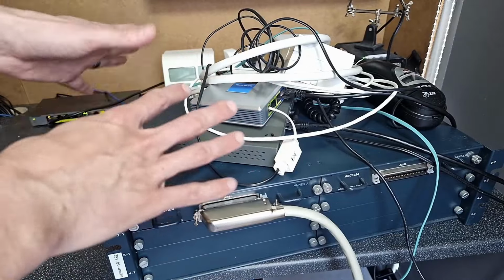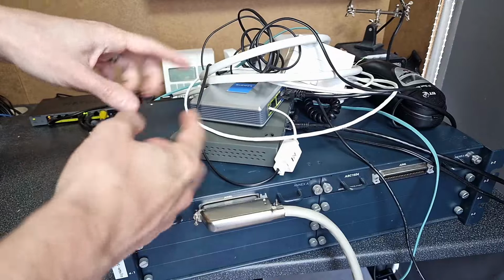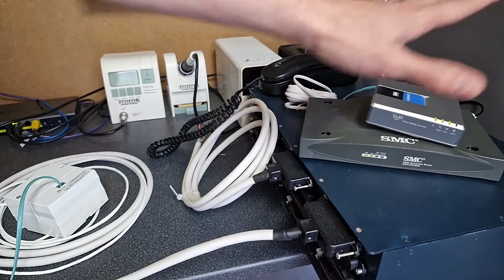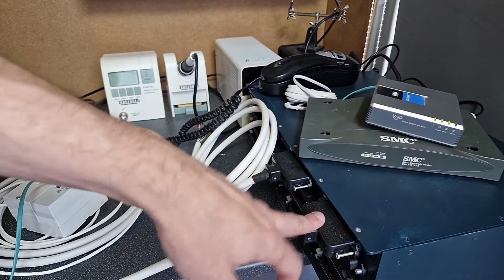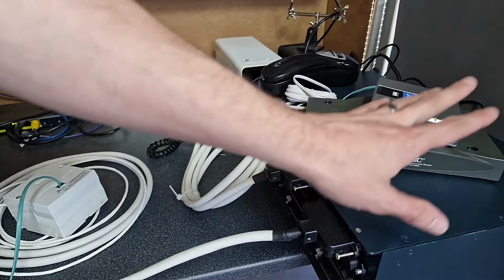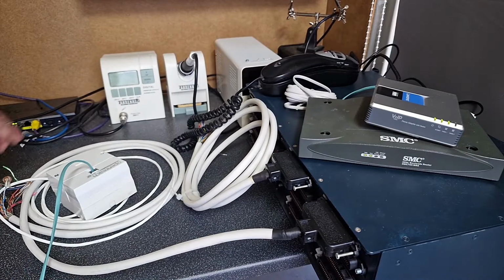And they're the two ports that we're mainly going to be focusing on while injecting the voice into this through everything else. So, on the front of the device, I said ADSL is coming in. Currently, it's coming out via this cable, which is coming out on the user port. Now, these are mapped to the filters on the front, as we've said in a previous video. That's coming through the telco cable.